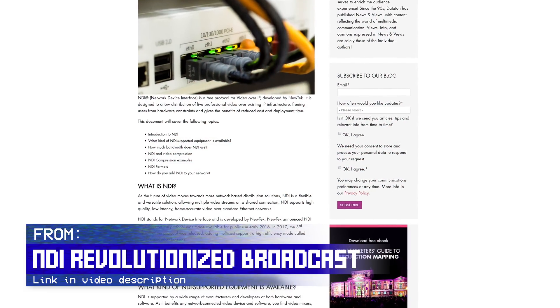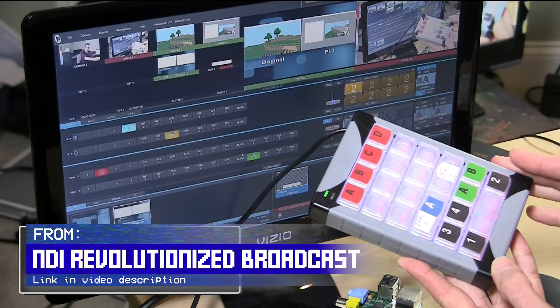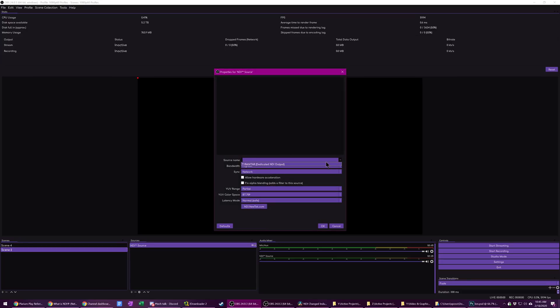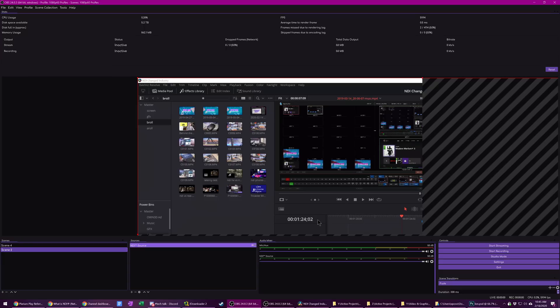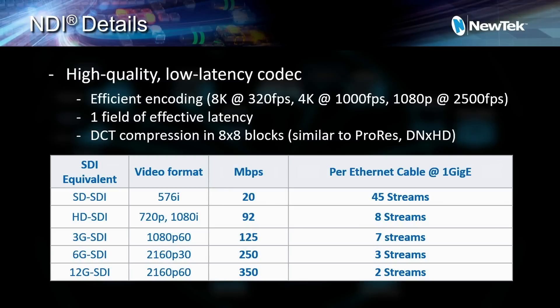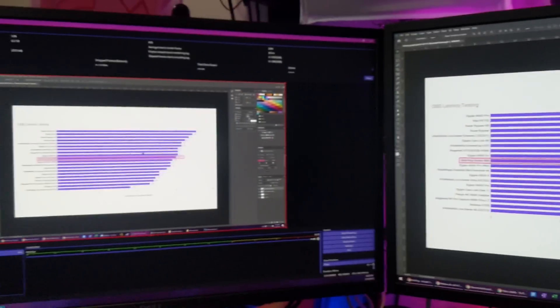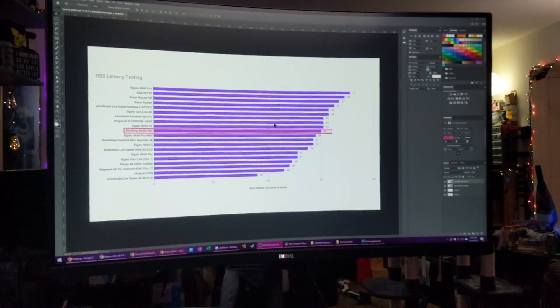If you don't know what NDI is and why any of this product matters, I highly recommend you go watch my video essay on NDI and how it's revolutionized the broadcast industry. To break it down, NDI is basically a transport protocol for video streaming over a network. So instead of connecting an HDMI or SDI capture card to your computer, you take an HDMI or SDI input and spit it out over the network. Then any computer, even simultaneously, can access that video feed. You can stream across floors or different parts of a building in fairly lossless-looking quality.